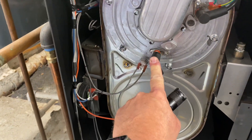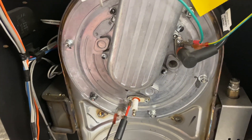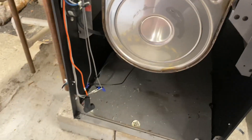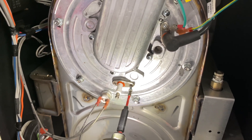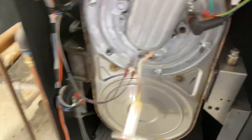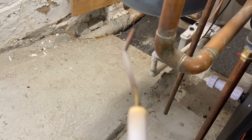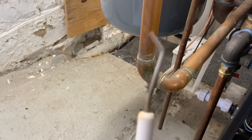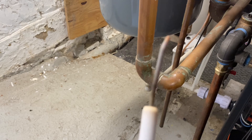Flame sensor, flame sensor, and igniter. Let's remove the harness for our flame sensor and the two screws that hold it on. We have a little bit of discoloration on there from some use — that's okay. We're going to take a piece of emery paper or open mesh scratchy paper and clean that up.